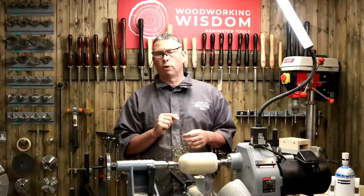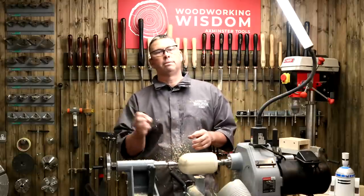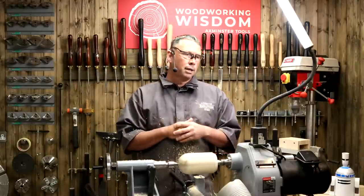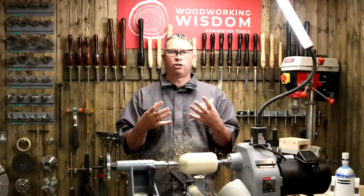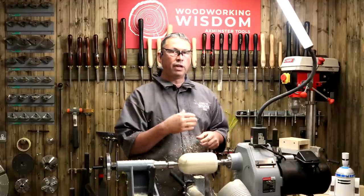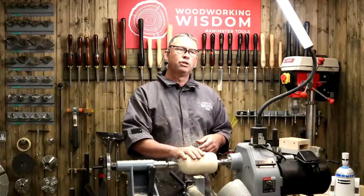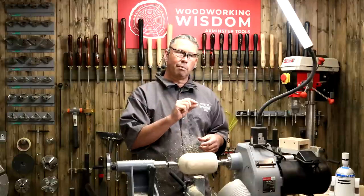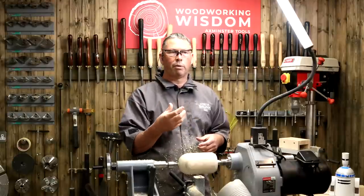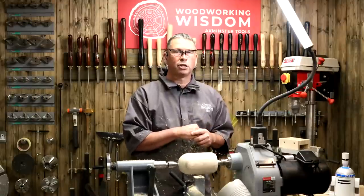And tulip wood is one of those timbers that if you paint onto a bare surface, it will keep sucking it in. So the texture of the paint will change from end grain to side grain if you don't. You could even go neat sanding sealer, and it doesn't really matter what sanding sealer you use. Just do a test patch with a particular paint. If you're worried about it reacting with a certain paint, just do a test patch first.